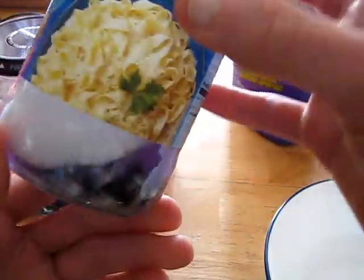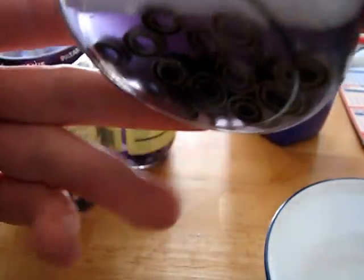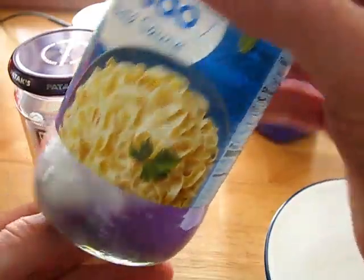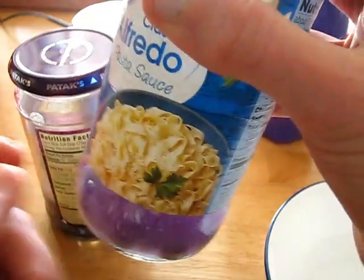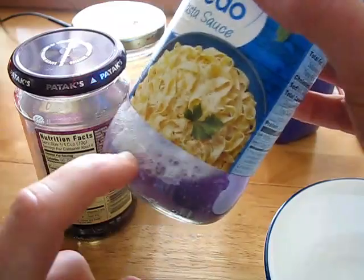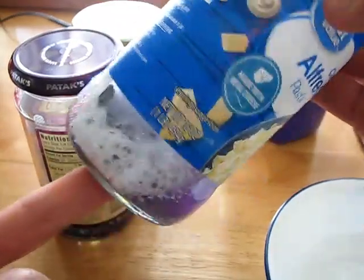It's been about half an hour since the last update and I shook this one around — they're looking pretty good as far as bearings without grease in them. For the next step, I'm going to use some water to see how clean they actually are. If they aren't fully cleaned, I will put them back in some clean degreaser to get that grease out.